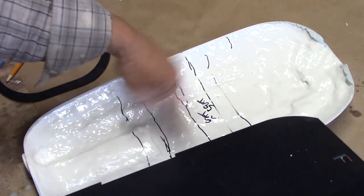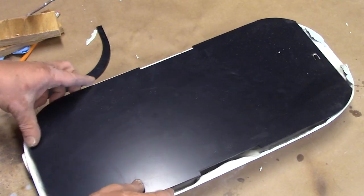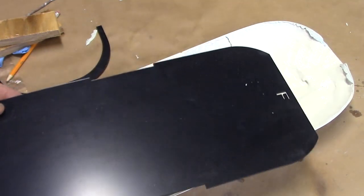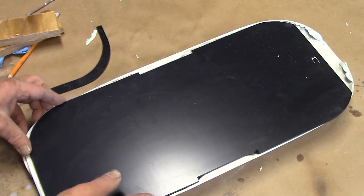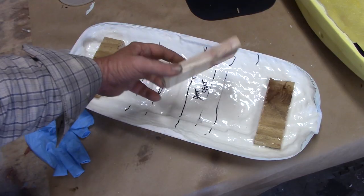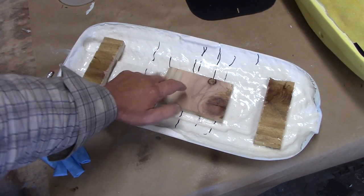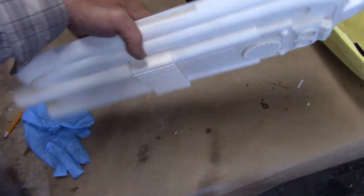I'm making the bottom pan removable — some of the electronics will live underneath the pan and feed down through the mount. So this will have to get a little bit of a trim to fit flush, and I'll be mounting that using wood — two wood blocks — and I'll bolt them down onto there. I'm also epoxying another piece of wood centrally right here, which corresponds with the screws needed for the Panavise mount.